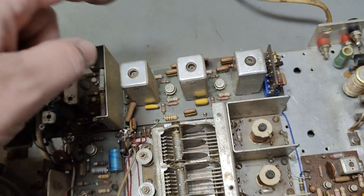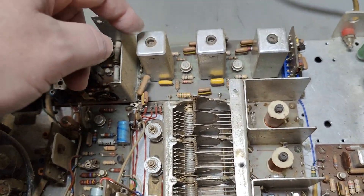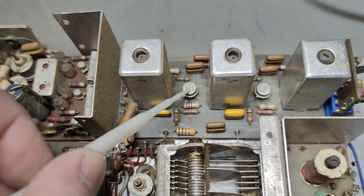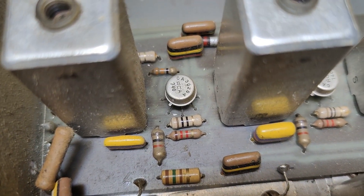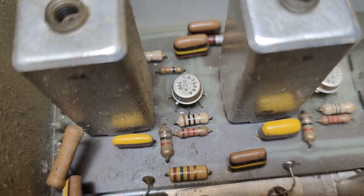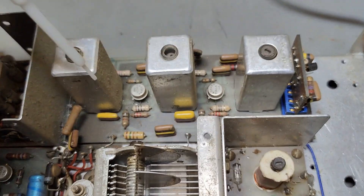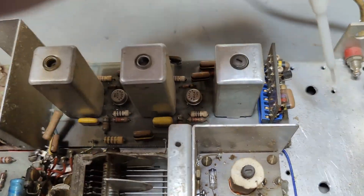This is the IF stage. We've got super nice filters here. I'm actually a little bit impressed they're able to do single sideband with these, but it's because they're using active amplification here. Those are a little bit special op-amps called CA3028A. They are very capable of handling those resonant circuits at a very high Q, so this way you can get very, very nice narrow bandwidth — and that is, of course, needed for single sideband.